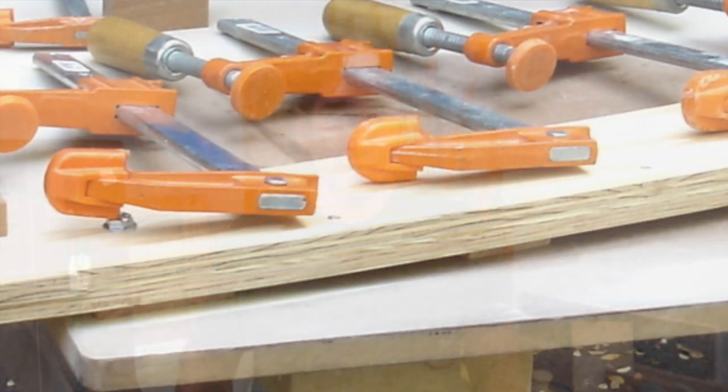And so the piece of trim would have to come up and then turn and have a twist right at the top. And so that was the most critical part of the actual bending. So the mold itself, I made it out of plywood, kind of matched the thickness of the sidewall. I matched the arc of it as well.